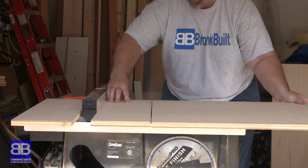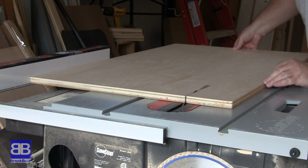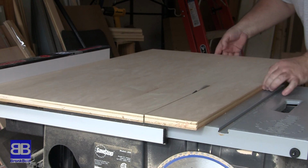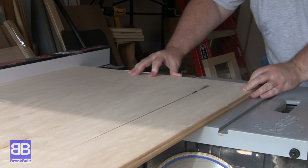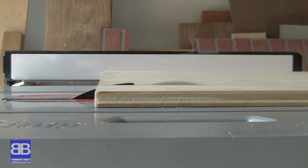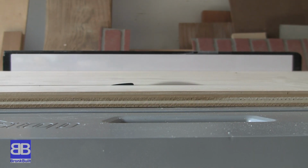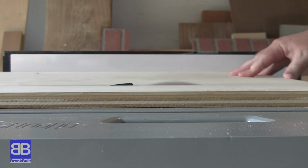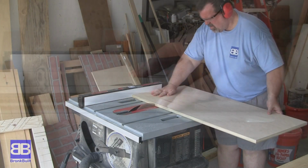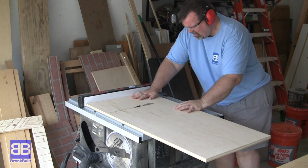Moving on to the next step, I need to cut out the two sides, the top and the bottom. Along with that, I need to cut the bottom piece of the front that will help hide the wheels. I do this on my table saw. My table saw fence does not allow me to cut as wide of a piece as I need for the sides, so I set the fence to the waste amount and keep the side to the left of the blade. If you have to do this, be careful to take the blade kerf into consideration on your measurements.